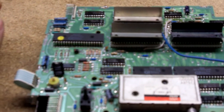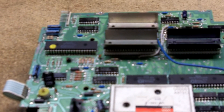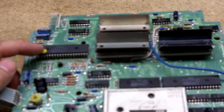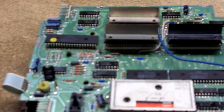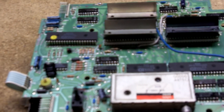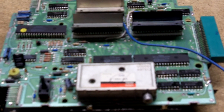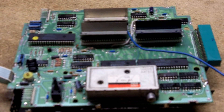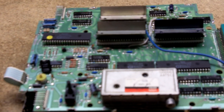If anybody out there is having problems after thoroughly cleaning the controllers — still having problems with the controllers either not working or not operating properly — this chip here is possibly your culprit. If you don't have an extra board laying around that you can steal a chip from, I did find a place online that sells these chips separately for about nine bucks. I'll put that website in the description. Any questions or comments, please leave them below. Thanks.